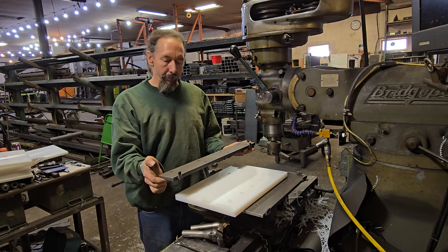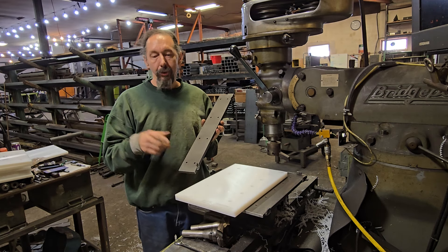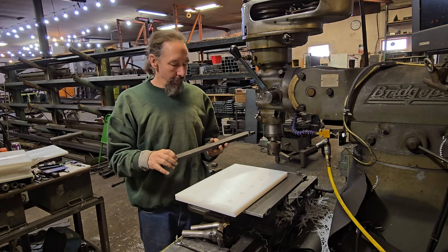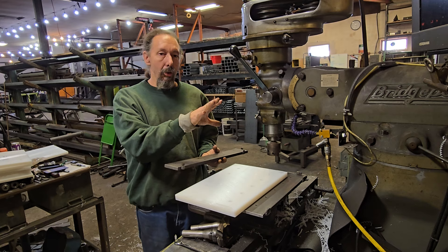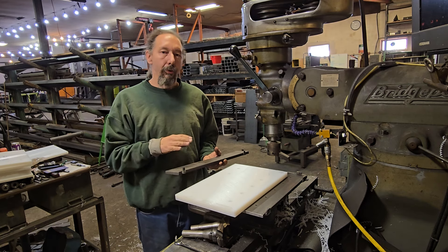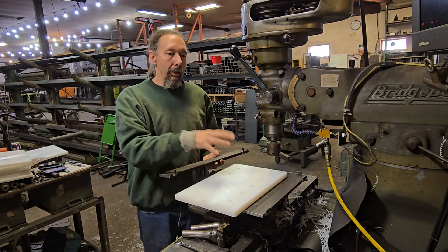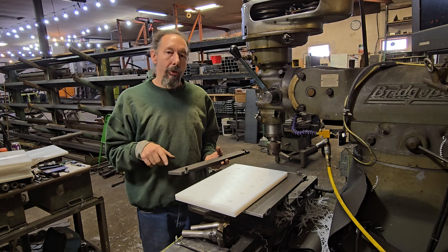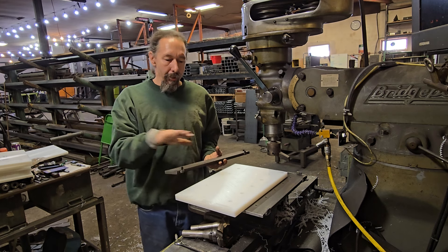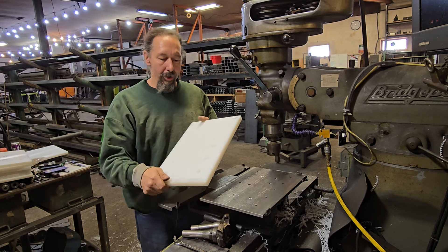When I'm doing these I always make a steel jig that can go into the vise of the mill, and we also use this with the magnetic drill for drilling the actual steel parts for our units. That way, even though you've got a DRO on the mill, if your math is off at all it can make for a nightmare later on. But if you make this jig for the mill and then just use your DRO to eyeball your holes, when you use this with the mag drill everything always matches.